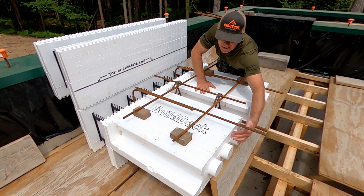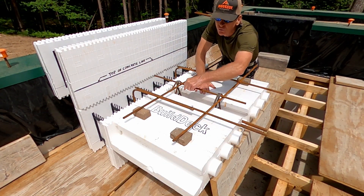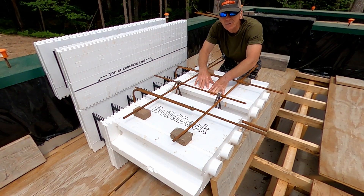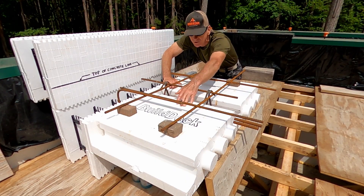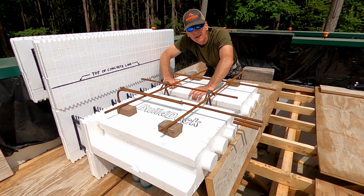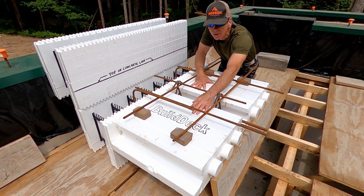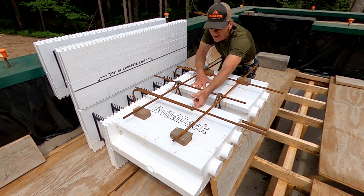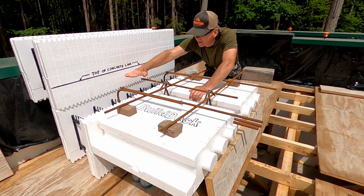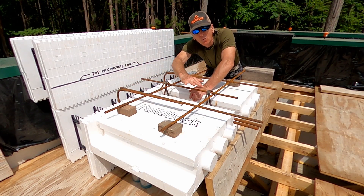So in my case, my project requires an 8-inch build deck — this is 8 inches here. These are roughly 2-foot by 2-foot pieces that plug together like giant Lego blocks. The build deck span system creates these I-beams, and with the heavy-duty rebar you can span great distances. You get the insulating factor of 8 inches of insulation with a 4-inch cap of concrete, and you get your strength through these I-beams. This all fills up full of concrete in here and it'll create one monolithic piece — the wall will be one monolithic piece with the ceiling.